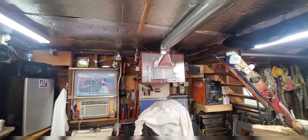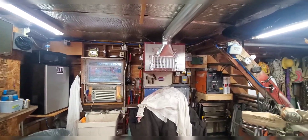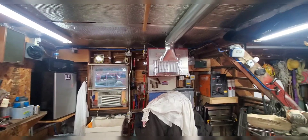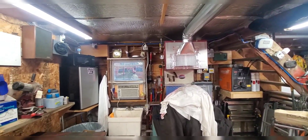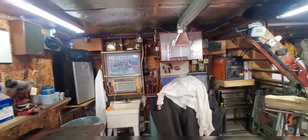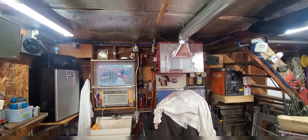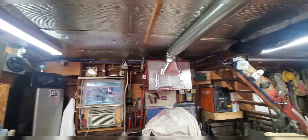With the new panel setup and that new controller I'm getting upwards of 1,700 to 1,800 watts some days in full sun. The batteries were getting down to sometimes five to ten percent and then switching back over to utility power, which I didn't want. Plus I didn't like running the batteries down that far. I only have three batteries, but now it gets down to maybe 75-76% and it bounces right back the next day, so it'll make my batteries last a lot longer.